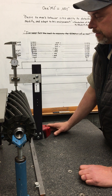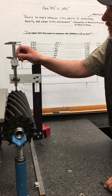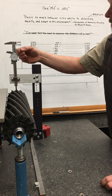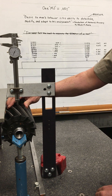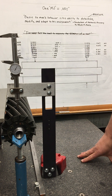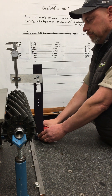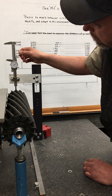It's just a coincidence that I'm getting close to zero here, because the diameter of this shaft is much bigger than the bearing journal. Moving down further to the left side of the shaft, I'm getting minus 5. So I have minus 5 on the shaft area compared to plus 1 at the bearing journal.